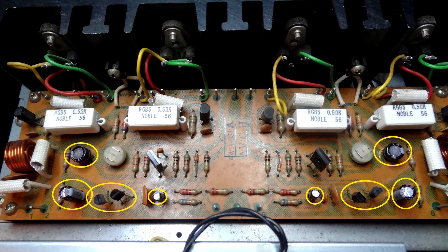There are the replacement capacitors put back in circuit with the correct values — especially that 47 microfarad which someone had replaced with a 100 microfarad. One thing I forgot to do after taking the capacitors out was clean the circuit board underneath with some cleaning solution to remove the glue and muck. I forgot that on this occasion — a bit sloppy really. But it's good practice to clean the board when replacing capacitors.